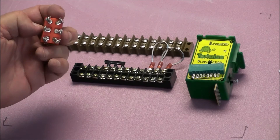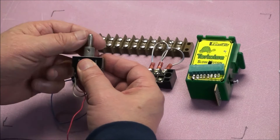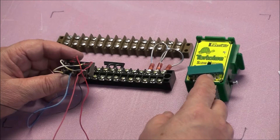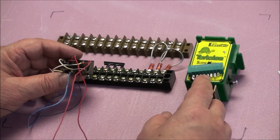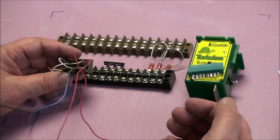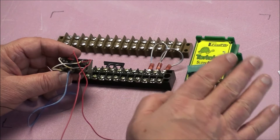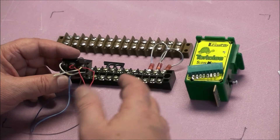There are other types of toggle switches. You need six connectors on the bottom — six terminals. This is a similar toggle switch, but it's an on-off-on, which means it has a center position which is off, and then on again. You don't really want to use this because the tortoise switch machine is a stall switch machine, which means it has power running to it all the time. As long as there's power, it will keep pressure on your switch to make sure it stays in position. If you take the power off of it, sometimes it'll back off and go out of alignment slightly, which could cause derails — and bear in mind, the power that runs this is not the same as your track power. So you're just better off using the on-on.